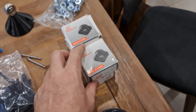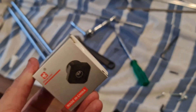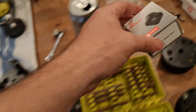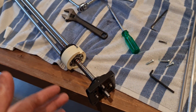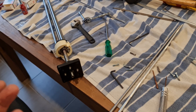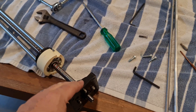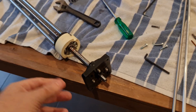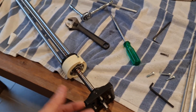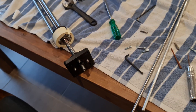I'm also replacing all the FK12s with proper ones designed for my 1610s — they're actually angular contact. The 1605s don't need the angular contact ones, but these are better quality. I get a bit of clicking noise at low speeds when the rig goes up — click click click. I've even heard that on PT actuators, so I think these bearings just aren't designed to take the load this way; they're supposed to lay more horizontal. At high speed you don't hear the clicks, only at slow speed.